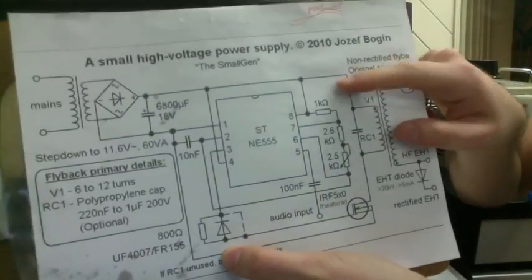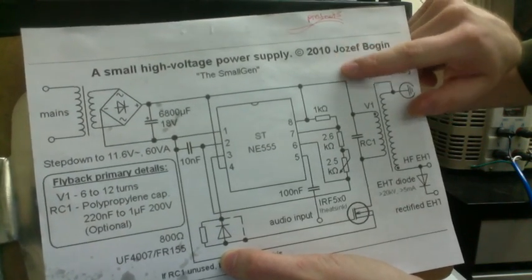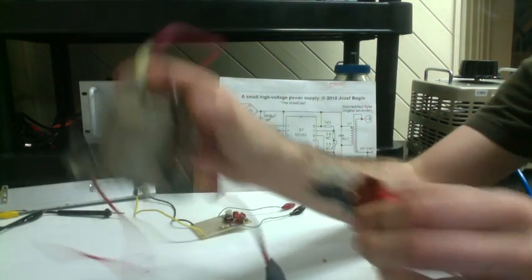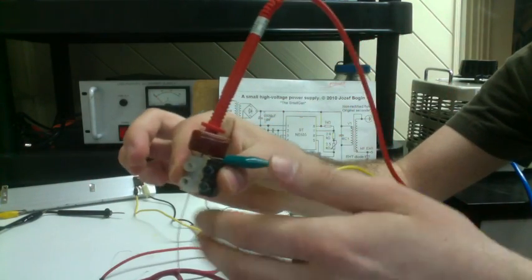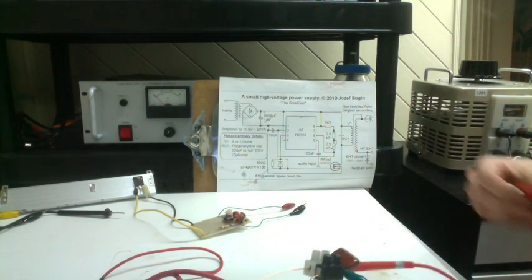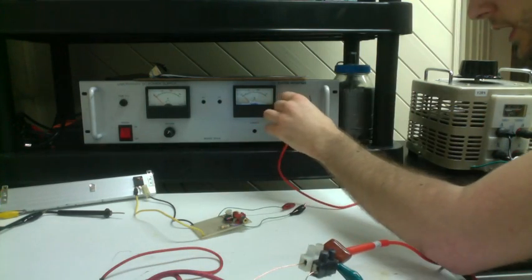Okay, here's one end of the primary coil, and remember I said you can cut this off. One end goes to the secondary power supply, which I didn't draw here. So we've got our connection over here. I already included a wire, and this goes to our big power supply because we're going to pump about 30 to 40 volts in it. So let's plug that in right now. This is the one I'm going to be using for that. Let's plug in that positive.